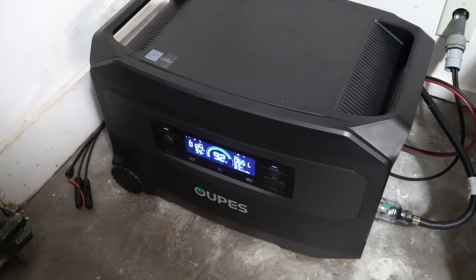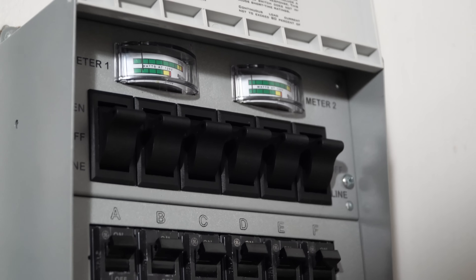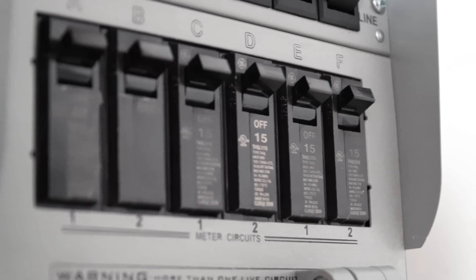I have the Guardian 6000 set up with my manual transfer switch. The 6000 is a 240-volt capable unit, and in a power outage it can deliver up to 6,000 watts of power at 240 volts and 3,600 watts at 120 volts. My transfer switch can utilize 240-volt split phase — it's a 6-circuit, 30-amp switch. It allows one side of the split phase to power three circuits and the other side to power the other three circuits. I could have a 240-volt circuit set to take power from the 6000 through two 20-amp breakers and then have four 15-amp circuits. I can also use all six circuits separately with the available 240 volts.